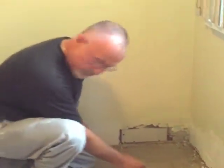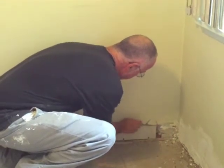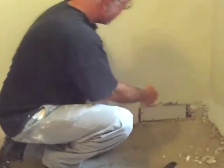We've got one last hole here in the wall we've got to repair, so we'll just do the same thing we've been doing all along — get this drywall tape up, tape it, put some mud on it. Now we'll just tape it up, mud it, and I'll finish all the flooring. Day seven is concluded. We've got all the holes where the baseboard was — it's all mudded. You can see overhead where the bulkheads were, we've got that all mudded and boxed in. Ceiling lights are done. Basically the next few days we'll be just applying more mud.